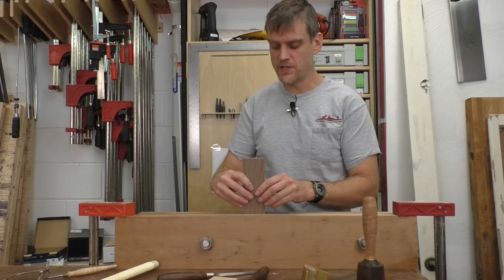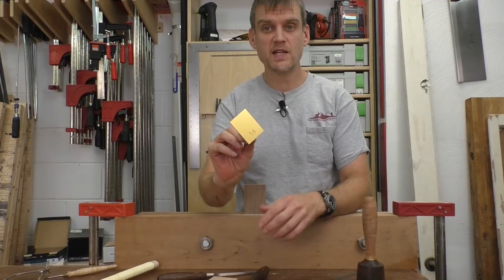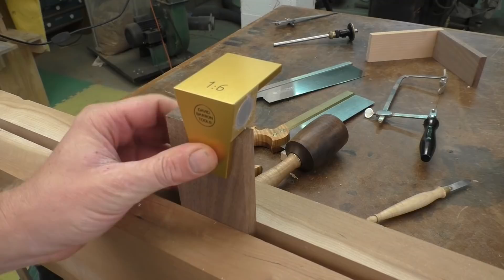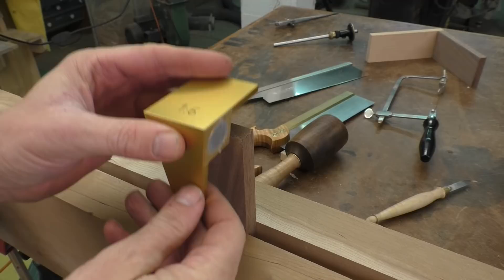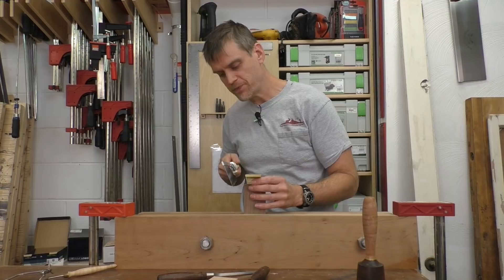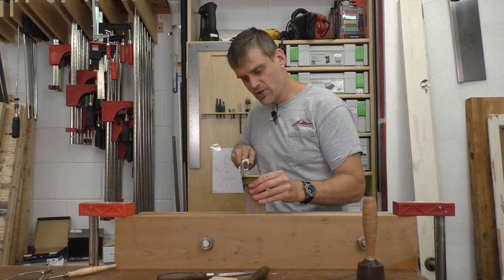I have marked the top of my board where I want to cut those tails. I am going to grab the 1-in-6 magnetic guide and put it on top of the workpiece — not in the front, but on top, so the magnet is above the workpiece. That is important to grab your saw. So I am going to let the magnet grab the saw, line it up right on my mark, and go ahead and saw down to the line.